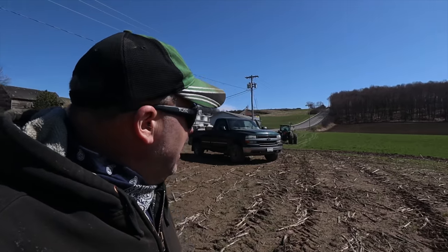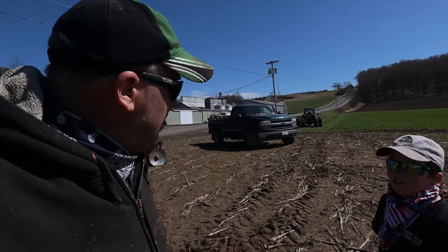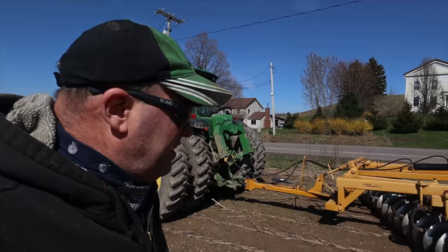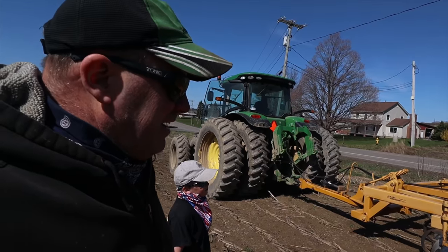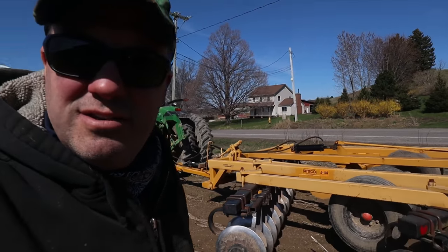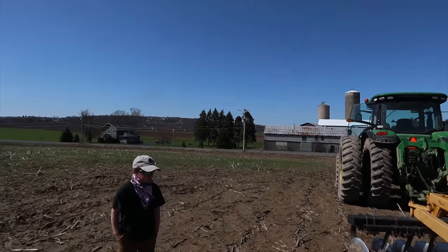So I said, well, you could offset disc with the 8320 while I'm going to Syracuse. What'd you say? I said, no, I need the 8360. All right, so he has spoken. So we got the 8360 on the offset disc. This is just a 15-foot offset disc. It does a real good job. It needs all new iron put on it here. And it does really well in these stonier conditions because it just doesn't pull up the stones. So he's going to go ahead and offset disc this field here.